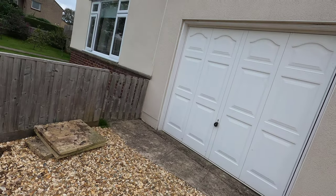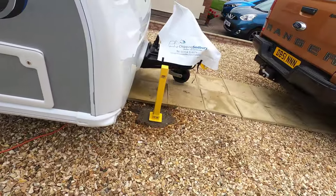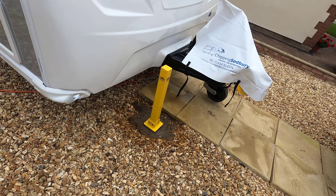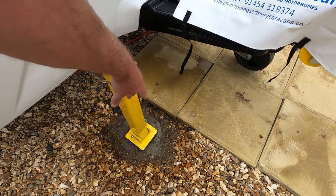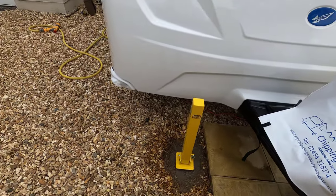A little bit hot and sweaty! So I took one of the old slabs from over there - one that had the corner - brought it over here and smashed it into pieces with the sledgehammer. Then I dug the hole to two feet deep, filled it with a lot of ballast and the old slab to top it up, got this in place, got the concrete in, put it level, and I'm just letting that go off. Luckily I made sure there's enough gap between the slab and the post to get the pin out. It looks prettier this way.